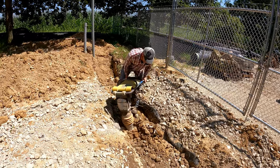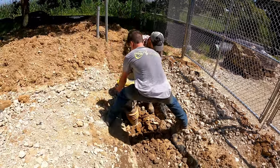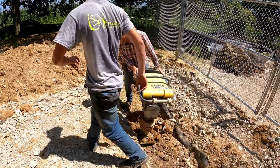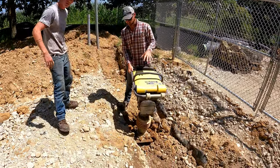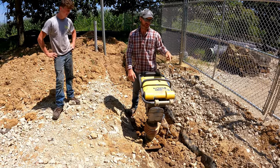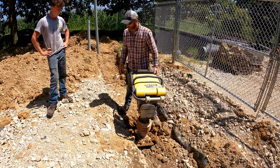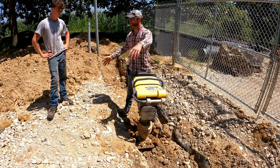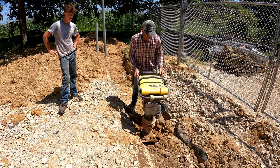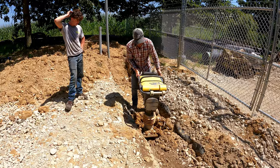All right, so we're going to bury this thing if we're not careful. Cam, you want to pick us up and get it up on that stone there? Not bad, 2 people, that ain't bad. But what you can see is it liquefies. If you've got a lot of moisture in there, it's going to liquefy the soil and just suck itself down in there. So that's what we're adding this stone in for, to give it something to work against. Cameron, when I get over that way, you can bring that skid steer up and dump some of this material in there. Again, just 2, 3, 4 inches. All right, we'll beat that in. So here we go. Oh, you brat. Almost.